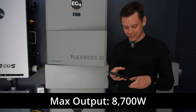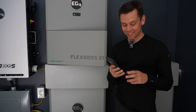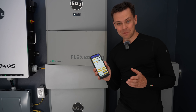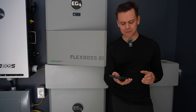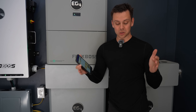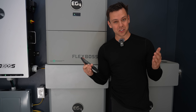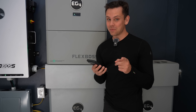Wait — what are these panels rated for? STC is 9,840. We should be producing more. That means we're not getting bifacial gain — or at least not the numbers on the spec sheet. I think the bifacial gain was a lot better when I had them on the bunker vault, probably because there was a lot more reflective material behind them. Right now it's just a big tan building. Maybe I need to paint it white — that would be fun to measure and we could see how big a difference it makes.